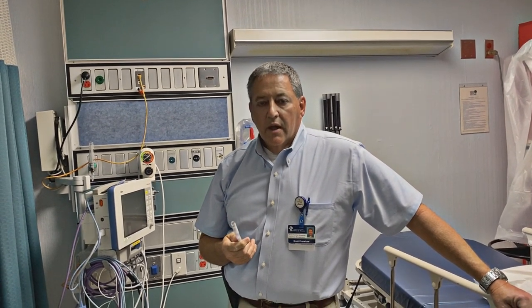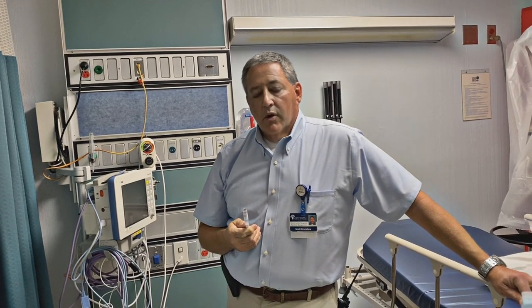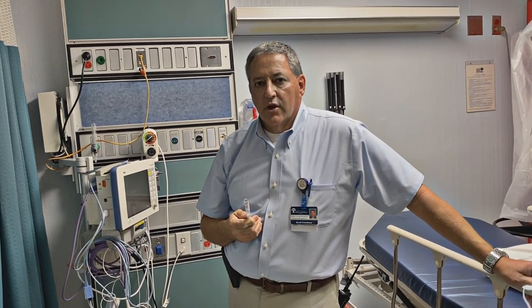We have actually already done this in two of our OR suites. I'm doing the same thing but I'm forcing the air with a HEPA air scrubber into the return to make it negative, and we were able to cut the supply down about 50 percent. So it still has some supply going in, but we have made two of my rooms negative pressure also.